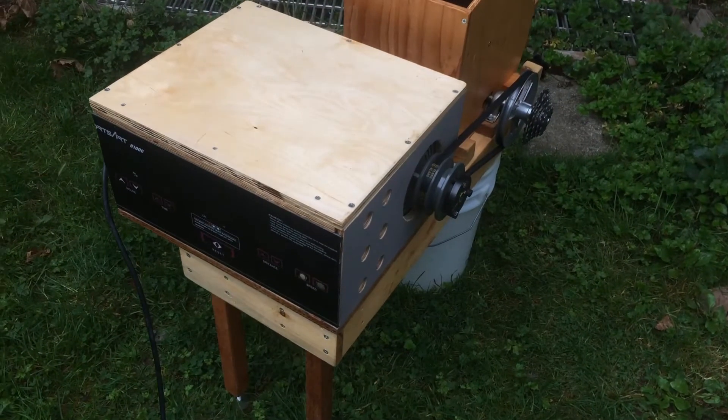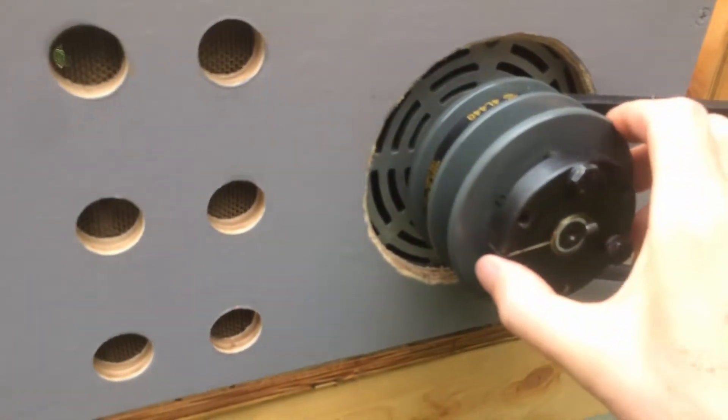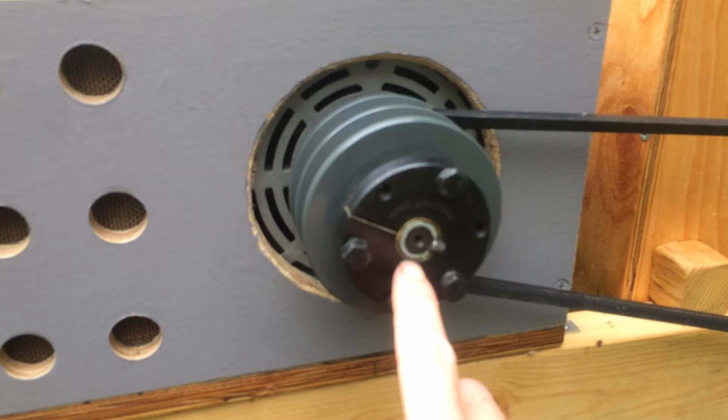The motor box itself is very heavy, something on the order of 50 or even 60 pounds — kind of a pain. Someday I might get a more appropriately sized motor. The shaft of the motor was unfortunately about 19 and a half millimeters, so I had to get some shims to get it up to about 22 and a half in order to use this quick disconnect bushing, which itself was really expensive and difficult to find. This whole set of adapters and linkages was very expensive to sort out — ended up being more money than if I'd just bought a one horsepower motor new. But at least now that it's built, maybe I can reuse it for some other project.